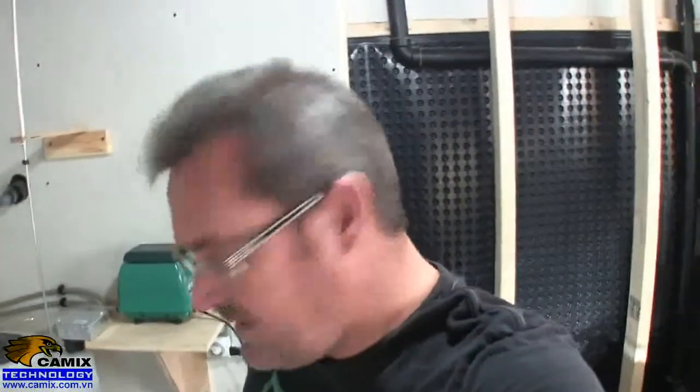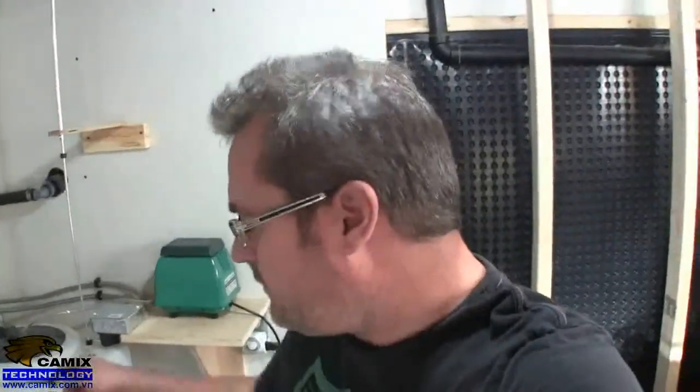There are some things that I'm not going to cover with this. I've got to cover the tank with insulation to stop it from sweating. Right now it sweats and it's making the floor wet. So I've got to box that in with foam insulation so that it stops that from happening. There are a few other things I've got to do with this system, and I'll have more detail on that in the website article that will go along with this when I get that done. That should be coming well within the next month or two.